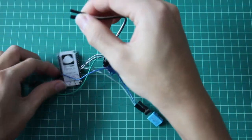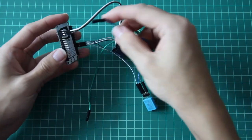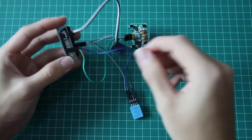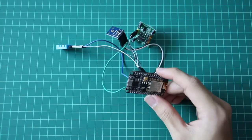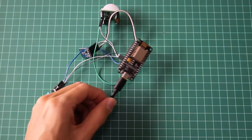The first thing I did was to acquire all the sensors as well as the Wi-Fi module. Then I connected them and wrote some simple code so that it reads the sensor information and publishes it to the MQTT broker that is hosted on my local server.